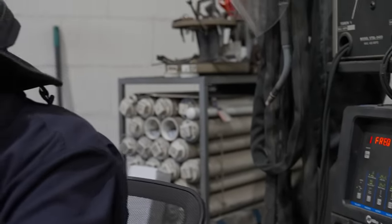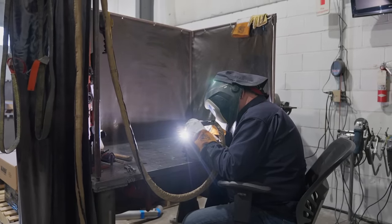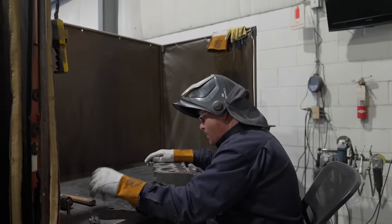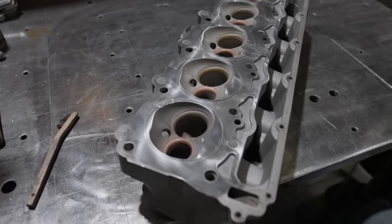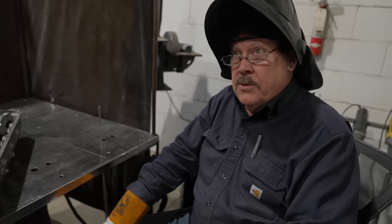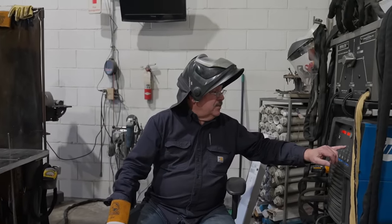Yeah, listen what this sounds like just while we're here. How high is that? Mm-hmm. But what that does is give you a smaller, narrower bead because that arc has to go back and forth 300 times a second. So its time on the part is a much narrower space. Right. So it's a lot of things to figure, but